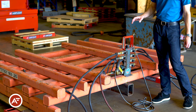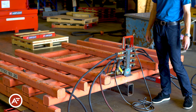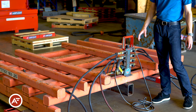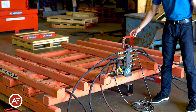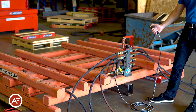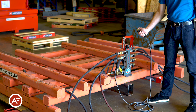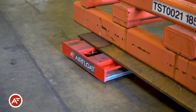Now we have a set of four air skids. This is a 12-inch skid set which can handle about 12,000 pounds. You can see we have the four hoses going out to each of the skids, connected to the central control and the dead man pendant. As I actuate the dead man pendant, you will see the air skids inflate and lift the load off of the ground.